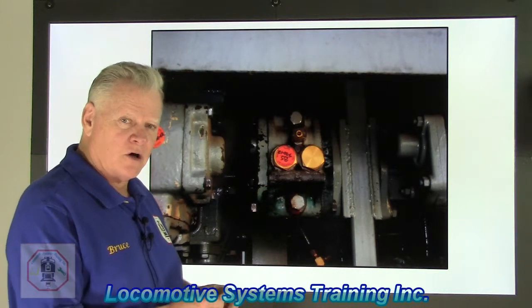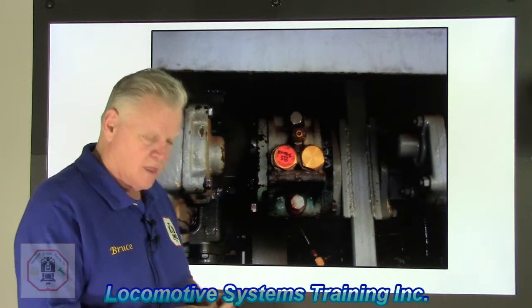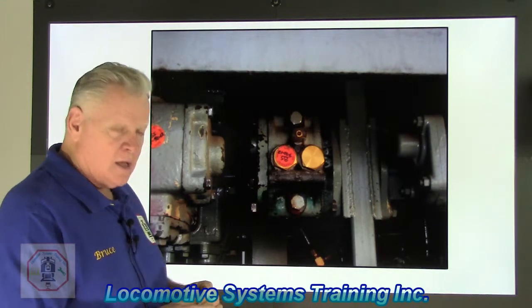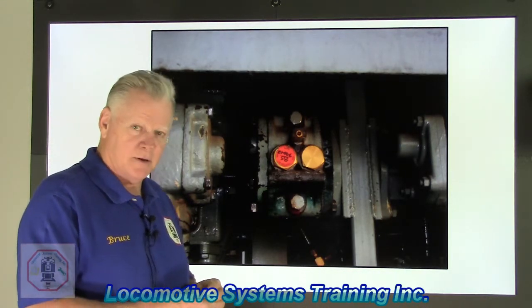Brake pipe charging cutoff goes to zero and remains at zero. Activates the PC switch, which drops the load, returns the engine to idle. Give me 1 minute of emergency sand.